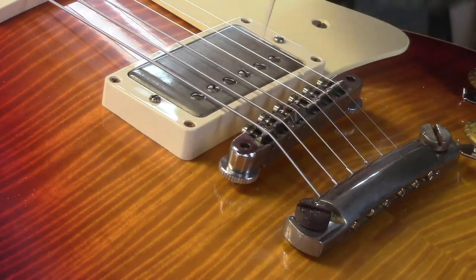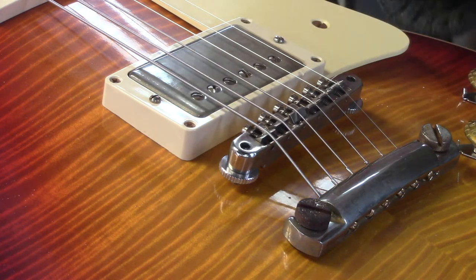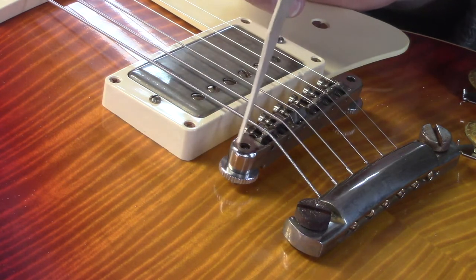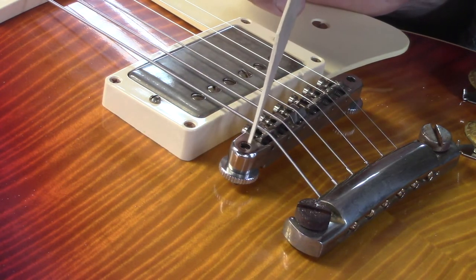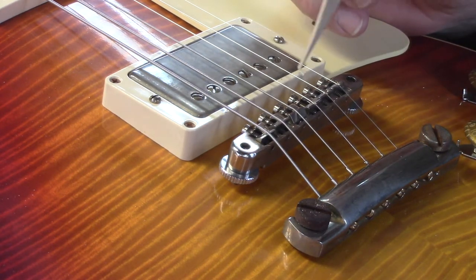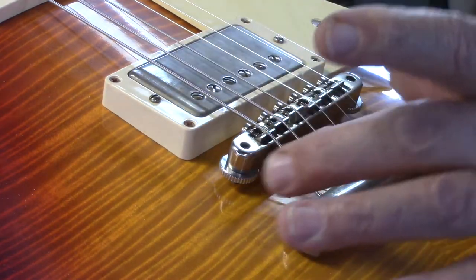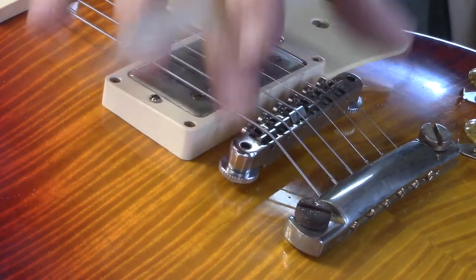Okay, next step. The posts actually go into the wood of the top. They're rock solid. Thumb wheel adjustment is good, but the actual inside diameter of those holes was not a perfect match to those posts. There was quite a bit of slop, a good 22 thou play. That's taken care of. We've got a beautiful press fit. All that movement and sloppy machining is taken care of.